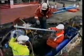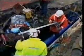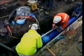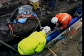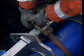The pipe ends must be thoroughly scraped around the circumference and free from contamination prior to the electrofusion couplings being fitted. The electrofusion coupler is then fitted in line. An alignment clamp can then be used to ensure that pipe movement does not occur during the fusion procedure.